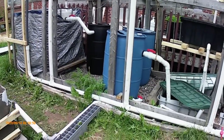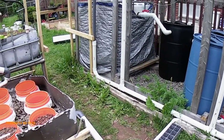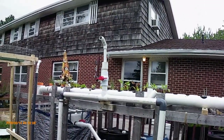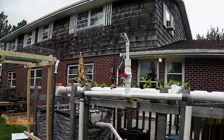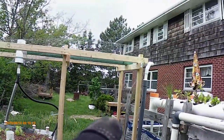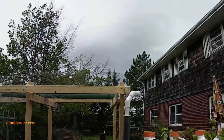Now, because of the speed of water, not all the bubbles can go up that way, so they get dragged a little further along until they hit that joint, and those will go up as well. All of that air flows back and forth until it hits this point, and if you crack that valve, it'll hiss. And the water, of course, now that most of the air's out of it, just goes up here. Peek around the corner, you'll see there's a little bit of plumbing work here.